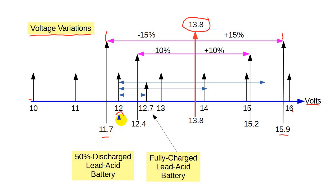Now, during charging, the battery voltage can go well above 14 volts, sometimes even 15 volts or a bit higher. So radios designed to work in a mobile environment, such as your UHF and VHF so-called mobile rigs, must cover the entire range. And 13.8 plus or minus 15% handles it all very nicely. By the way, that's where 13.8 volts comes from in the first place — it sits nicely athwart the normal automobile voltage excursions.